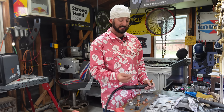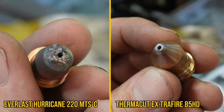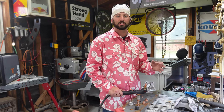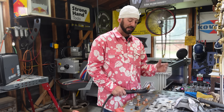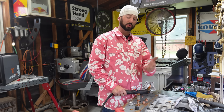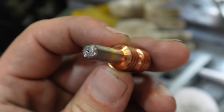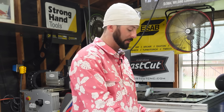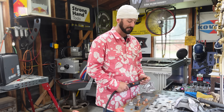The biggest thing I check is the nozzles. The nozzle sits right on there on both machines, and different amperage ranges are used because the orifice size changes — the size of the tip opening gets bigger or smaller, which definitely changes the type of cut. Make sure you have the right nozzle. You'll notice wear when the center of the electrode starts to pit and the nozzle hole gets gummed up and chewed out. You want a nice, clean electrode and a clean nozzle.